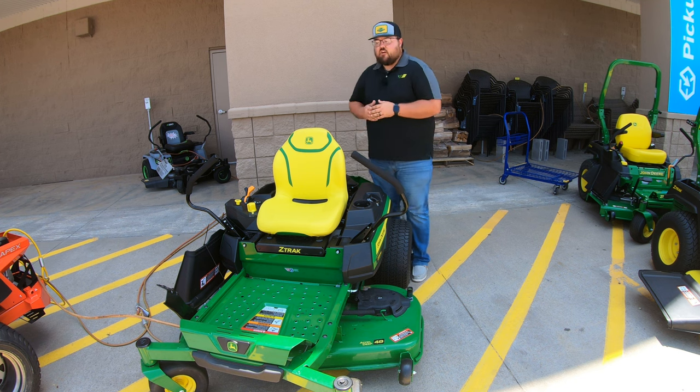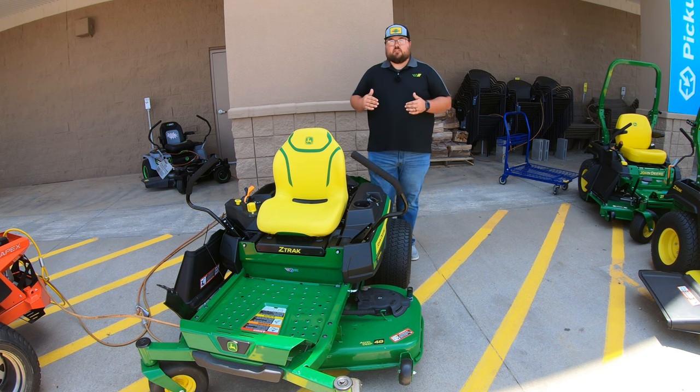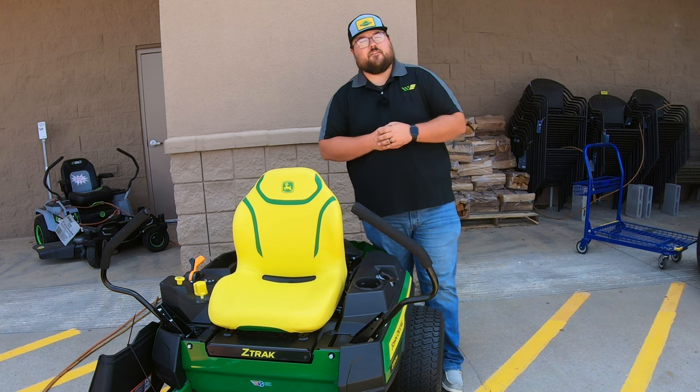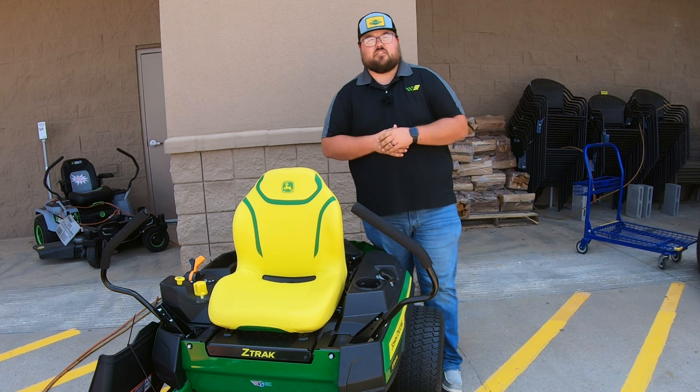Lastly, let's talk about specs. Overall length is going to be a little over 75 inches. Height is just a touch over 44 inches tall at the top of the seat back. As for width, people often think a 48 inch deck means a 48 inch wide machine, but you're not accounting for the extra on each side of the deck and the deflector — on the 48 inch deck your overall width with the deflector down is closer to 62 and a half inches, and the 54 inch deck comes in at 68 and a half inches. Top forward speed is seven miles per hour and top reverse speed is five and a half miles per hour. I hope this video helped you out — if it did, hit that like button and subscribe. For John Deere parts, check us out at 247parts.com.